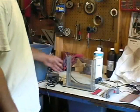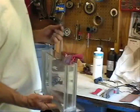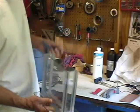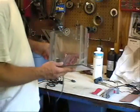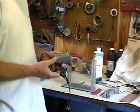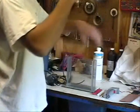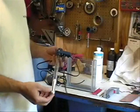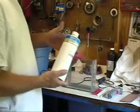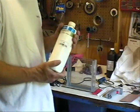The things you need for etching: one, you need a tank. This one's a homemade one — it has air agitation, which is simply a silicone hose with a series of holes drilled into it at the bottom and glued in with silicone. Then you need an air pump, which is nothing more than a fish tank air pump. And a heater — this is a fish tank heater also. Of course you need ferric chloride. I use ferric chloride; there are other methods you can use. I like ferric chloride — it seems to be the safest out of all of them.